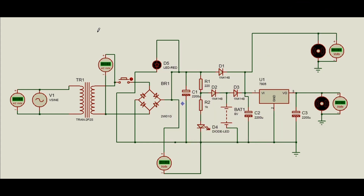The circuit works such that it first steps down the AC power to the level required by the computer. It then converts the AC power to DC power through the full bridge rectifier. Then it uses capacitors and diodes to filter the circuit. The circuit charges the battery when power is on, and when power is cut, the battery provides power to the circuit almost instantly due to the filter circuits.